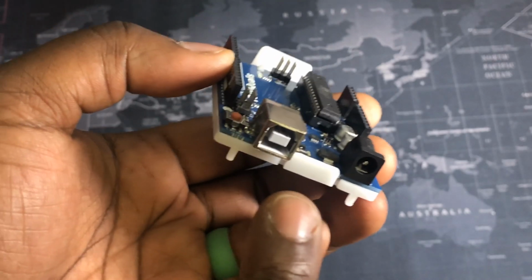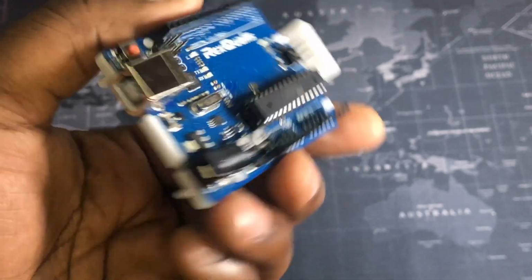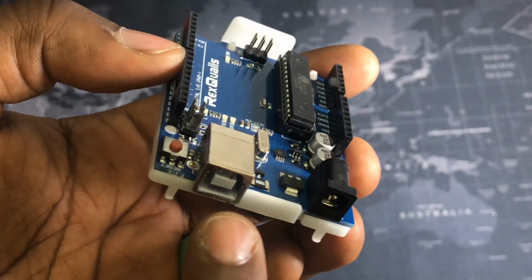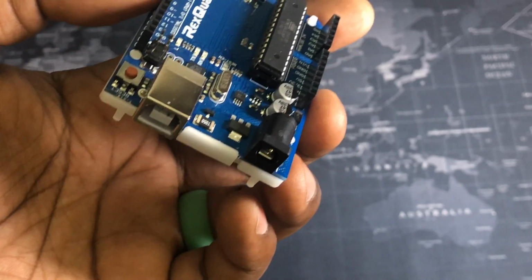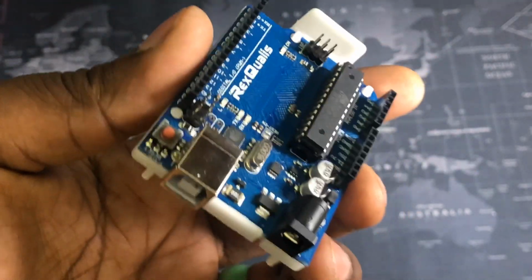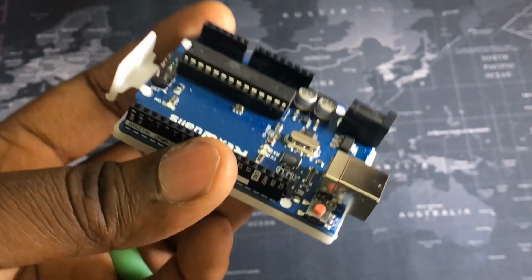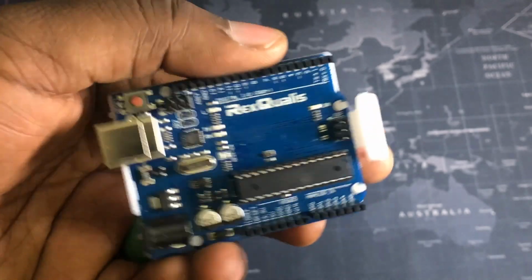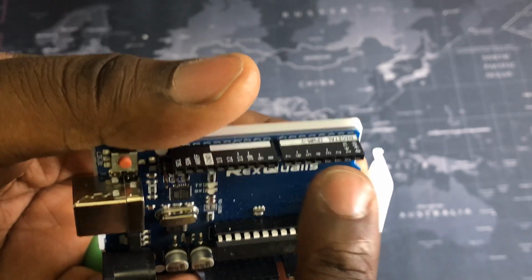Because I said USB 5 volt. Well, that's what this is for. You can run a standard DC socket into this, and this can be powered up by 12 volts. So you can write your code and send all your code over via your laptop or your PC or your MacBook, as in my case. And then when you're ready to go, you can unplug this and plug it directly in via 12 volt on your car. This will immediately start up and start to execute your code. So what does that really mean? Well, in simple terms, it can be as simple as, if you look here and you see these pins here, you can program these pins to send voltage out or ground out.